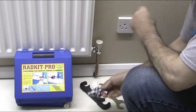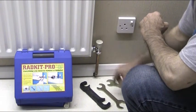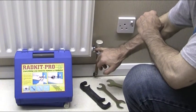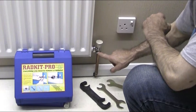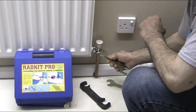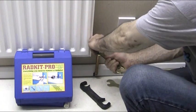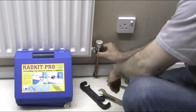The first thing we need to do is take this valve off. We've got two nuts — the inlet nut at the bottom and the union nut. The first thing to do is slacken off the bottom nut. Don't undo it completely, just slacken it off. They can be pretty tight so get a hold of the valve and just slacken it off like that until it's finger tight.